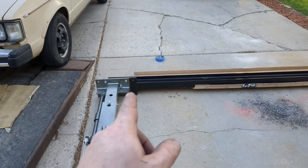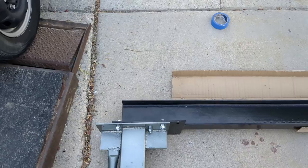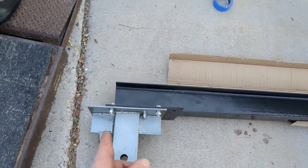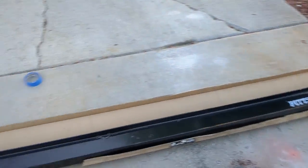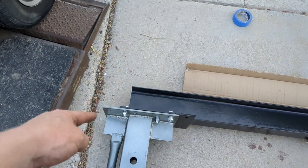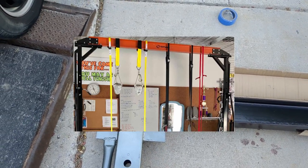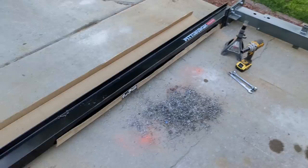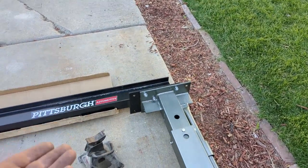Twenty or thirty minutes later, we are at 102 inches. I ended up moving each one over two and a half inches. You can see the I-beam still sticks over about a quarter of an inch over the outside of the beam, which is plenty. I was actually going to put a little kicker leg down here and maybe one up top, but the way it sits right now there's no need to. I'll just leave it as is, and if I ever need to move it wider I already got the holes drilled.